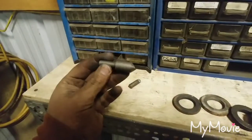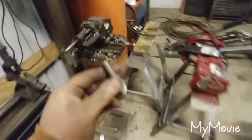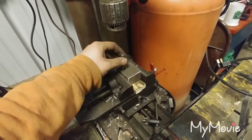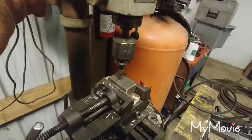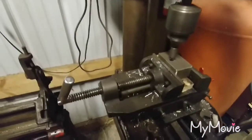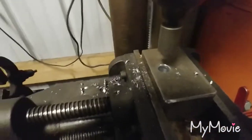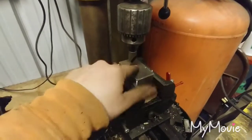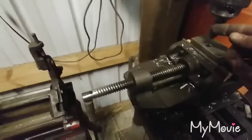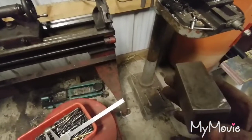I'll take this chamfering tool — some people use it for center drills, but this little chamfering tool — put it in here and it'll come down and just break these corners. I got the chamfering tool in there, and it should just come down and kiss it. That breaks the corner and leaves a nice rounded edge — only takes a second. Some people put these in a drill; when I was a machinist I used to put these in a drill and just deburr my parts afterwards. Now I'll flip it and drill a set screw hole.